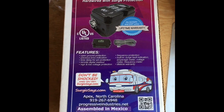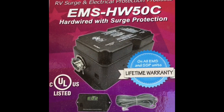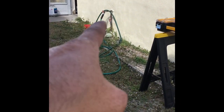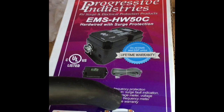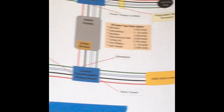The next thing to be installed is the Progressive Industries EMS HWF 50 - this is a hardwired unit with surge protection. What this does is protect the coach from any surges or spikes. This wire gets connected to this unit, and then from that unit it goes into the automatic transfer switch, and then from the automatic transfer switch into the service panel. There's a chart right there.